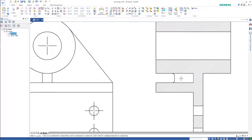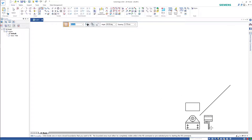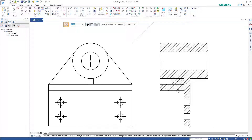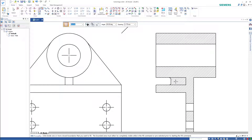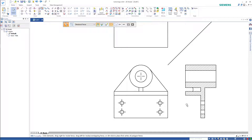That web is not sectioned. If I were to section it like so, that would tell the viewer of the drawing that it's a fairly solid chunk of steel — but it's not. That's only a little thin stiffening web, so webs are not sectioned. There is your sectional view, and the top view is even easier.